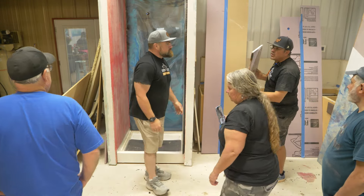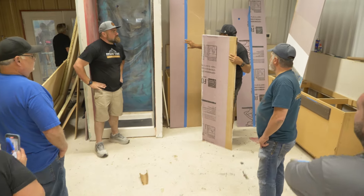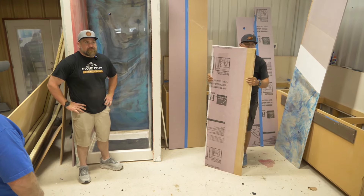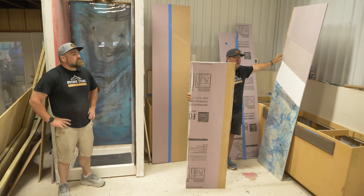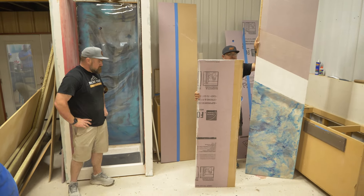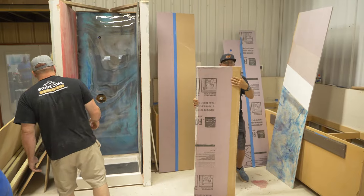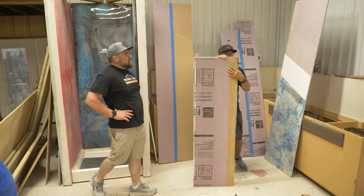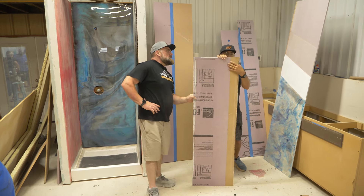The other thing too is when you're adding pieces of wood like this, you're going to use Quick Coat — you're not going to use the 2P10. Like you saw us put it on here with this little strip right here, we just used 2P10 and it won't hold it. So what you need to do is put Quick Coat just in that seam, put tape on one side, open it up, fill it with Quick Coat, and then put it together.